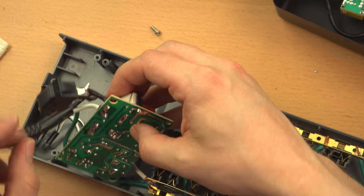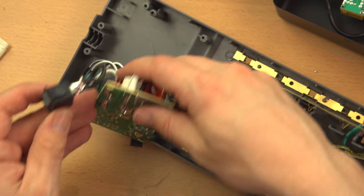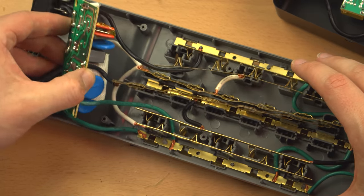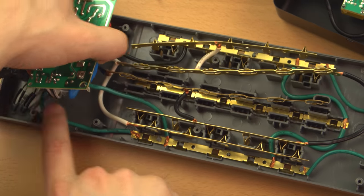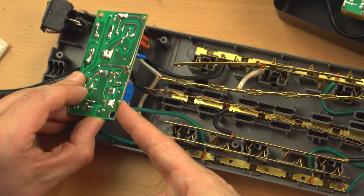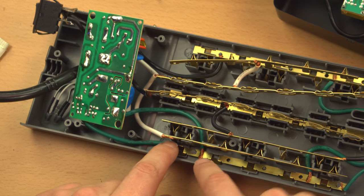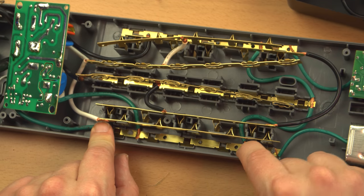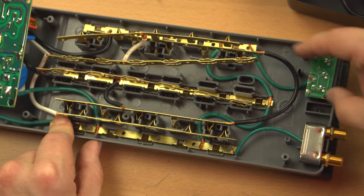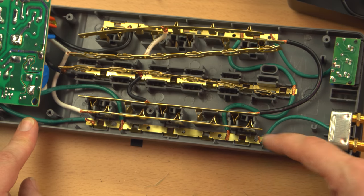The switch slash breaker comes right off the live connection, so when that's off, it's actually shutting off this entire module, which is a good thing. That's what you want to see. And yeah, otherwise, the grounding wire comes in from the cord, comes straight around to this bus bar, jumps off that bus bar back onto the surge suppression module and possibly RF filtering module. I mean, like I said, there's a lot going on there. And then it continues to get jumped off this bus bar to the central one, then to this one, and then the phone comes off of this one, and the coax cable protection comes off of this one. So everything basically comes off this bus bar.